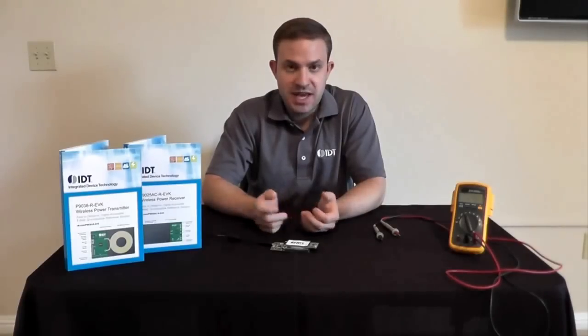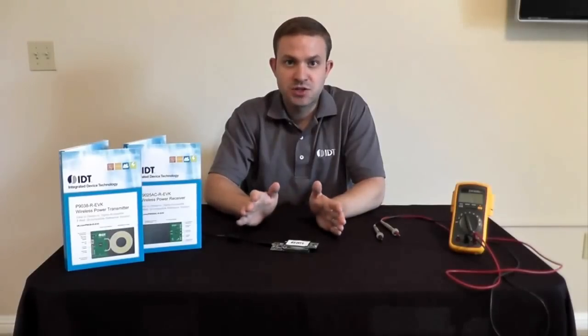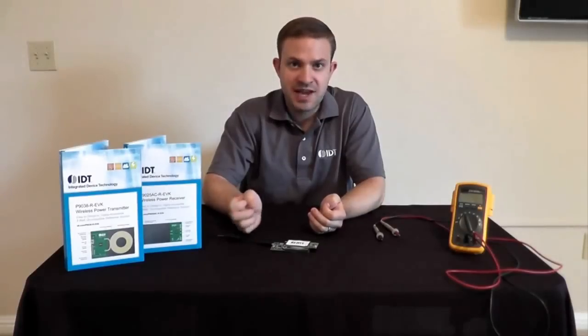But this is just the hardware. The most important thing about these kits is actually the digital collateral that comes with it. We provide not only the standard schematic, bill of materials, and Gerber files, but we've gone a step further and we actually provide what's called an MDD import file. So if you use Cadence Allegro for your board layout, you can take that file and import it right into your system layout — it comes as a symbol that you just drop right in, maintaining the optimal layout we've created for you with absolutely no changes required. We also provide a complete layout guide if you do desire to make changes, as well as a foreign object detection tuning guide with an Excel-based calculator where you take a few measurements, plug in some values, and it will tell you the two resistor values to put on your board to tune your foreign object detection.